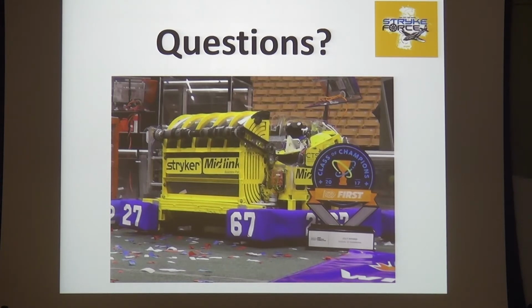So you can do all the tuning. Yeah, you can do all this. You can tune all your axes with the utility. The grapher, so if you integrated this with your robot, and it's documented up on the website, there's a pretty simple JSON format data exchange between the robot and the grapher. You could probably recreate that pretty easily. You'd have some work to do it with LabVIEW if you wanted to watch your live robot, but certainly for testing, you just load the Java Virtual Machine up on the Robo-Rio and you fire up the tool and you put your grapher up and away you go. So pretty easy for anybody to do this testing.